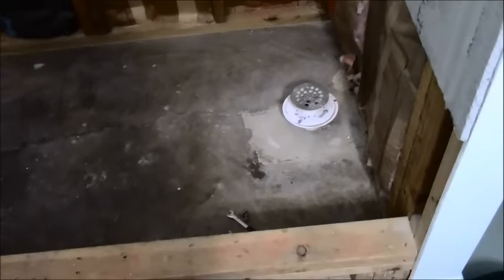All right, so I managed to get about another 9 inches or so coming out this direction. My drain will eventually set here, which is a good foot off of the wall. So what I'm going to do is get in here with my Dremel, cut that inch and a half pipe. I don't have a 45 with me, so unfortunately I have to stop what I'm doing, but I'll cut it down probably around the middle here.